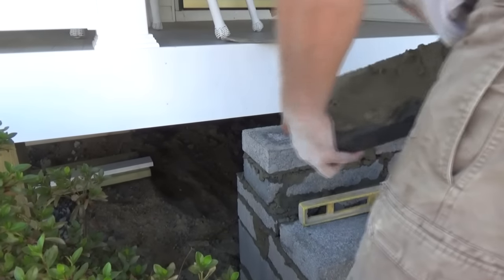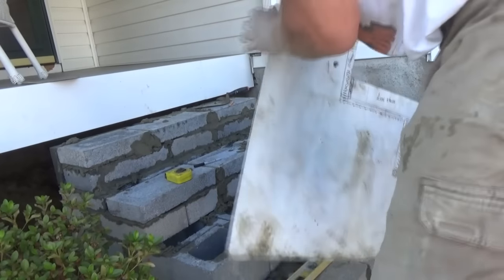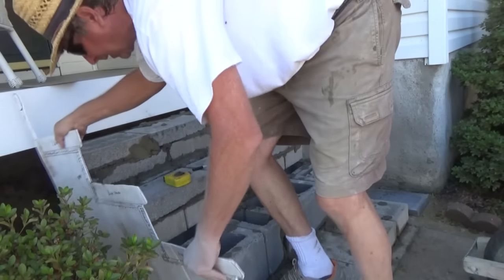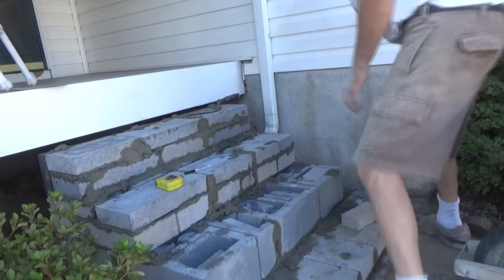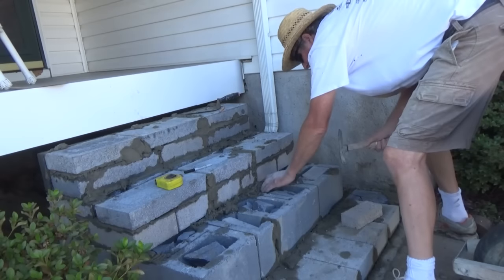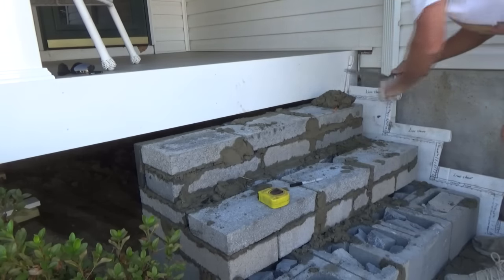Just like stick-on stone, they plaster it up a little bit. Get it right in there — that's the back of my stone. Now I'm doing my final check with my pattern, making sure I didn't make any mistakes. Right down on the footer — that's it, that's where it goes. Now I'm ready to put my stones in. I'm taking all this stuff and filling in these holes so we can put our steps in. I'm going to put my first piece of limestone on, going by my pattern right here for about how much cement I'm going to need.